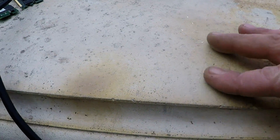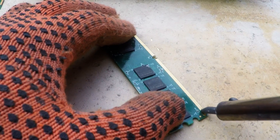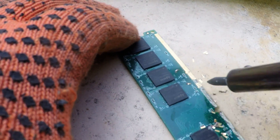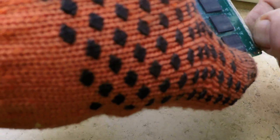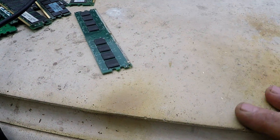I recommend doing this outside anyway, because even though there's not much fumes, just a little bit of fumes come up. Today it's a nice windy day so I'm not getting any fumes from the glue that's being melted off. And if you leave the soldering iron a little bit too long on the board it will start to burn the board, so you just want to keep running it along and not get stuck too much in one spot. Alright, well I'll keep going and I'll catch you soon when I'm a lot closer and we'll see how our little stockpile is looking. Keep scrapping and don't forget to watch out for the update video — it should be pretty good.